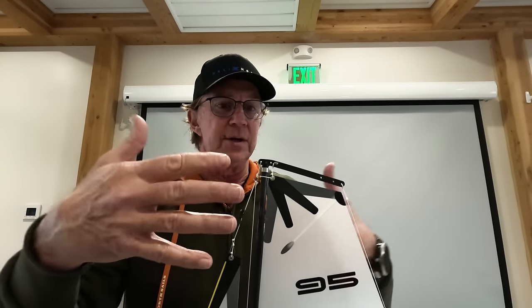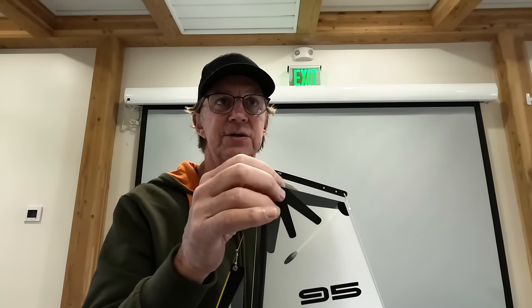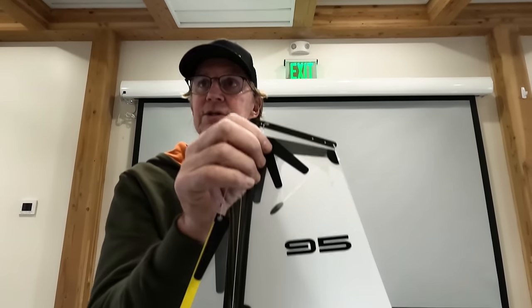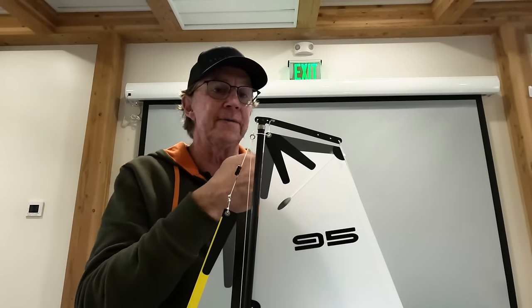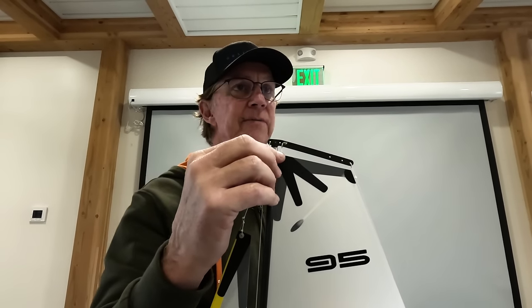When you turn to go downwind, especially, the top of your mainsail is all screwed up, right? And that's all because of the positioning of this string. So first of all, I used to have it 2-to-1, and I now just have it 1-to-1, so it can swivel that much easier. 2-to-1 kind of held the large roach of the mainsail from going out very far. So it's 1-to-1, and it's right to the bottom of the silver band.